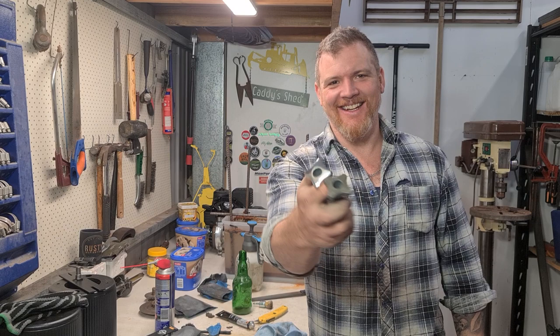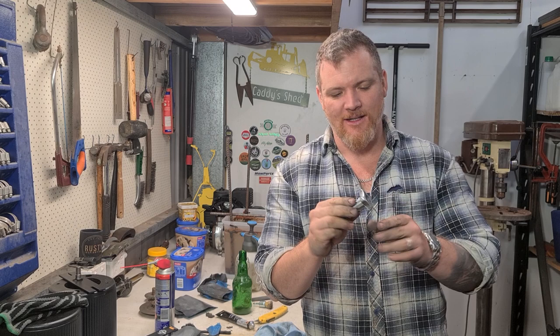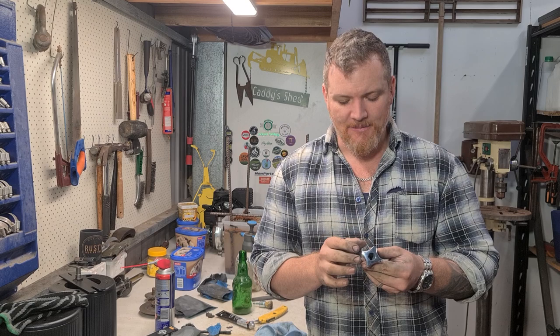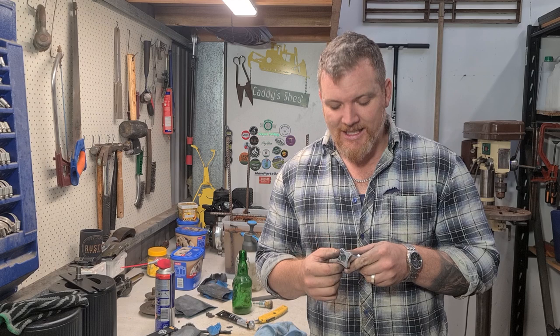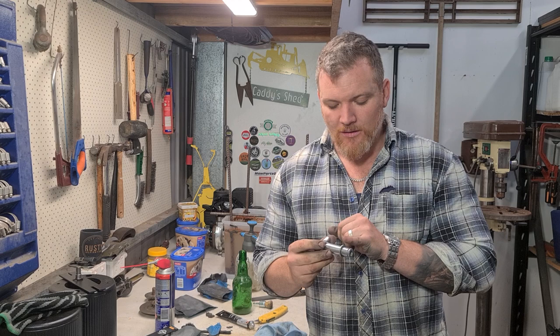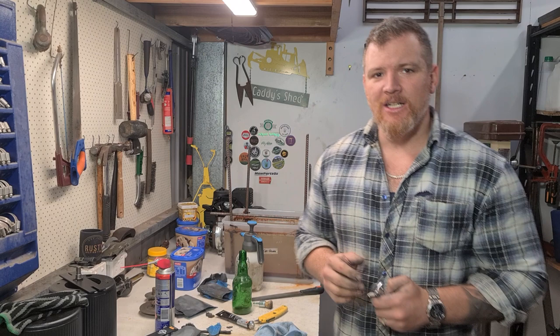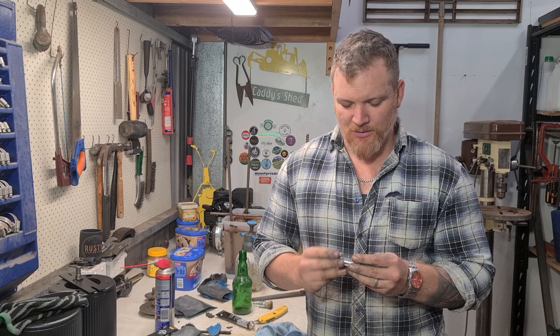My knobs are well and truly polished, mate — look at that. That's the difference between the two: here's a typical old one that's been around a while, and here's my new one. I only got down to P1500 on this one and there are still a few scratches and imperfections, but I'm happy with that. If you are going to break out the file, just be super careful because I have taken a few scuffs in through here. Where I've taken the mould joint out, that looks a million bucks. Just made sure I took my time with the P80 to get most of the real deep gouges out, then went up from there.